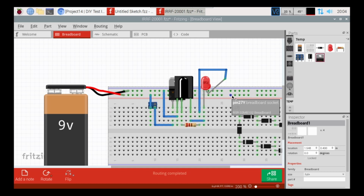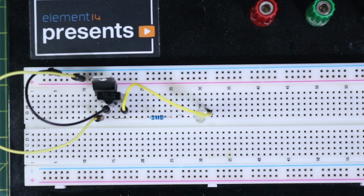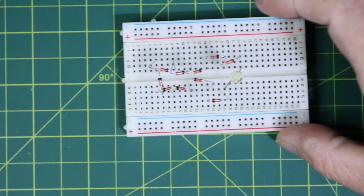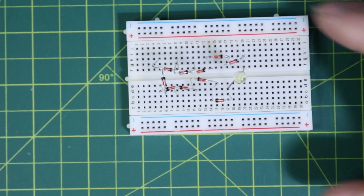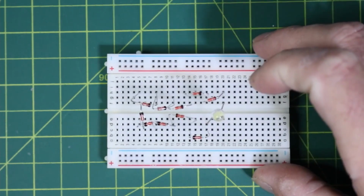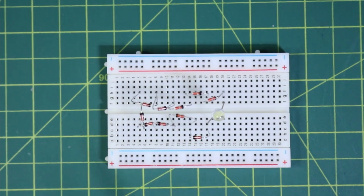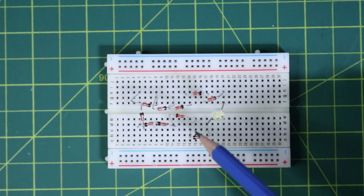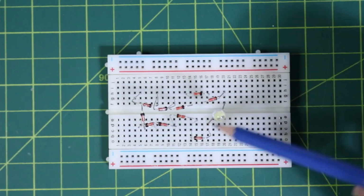With that being said, let's take a quick look here at our workbench. I do have this one here, but you did see this one on that diagram. I definitely need to get a better lens for getting in a little bit closer. Basically all we have here is 10 1SS86 diodes, and that is what we were seeing over on our Fritzing on our breadboard. So basically it's just going right around in a circle from one end of the LED to the other.